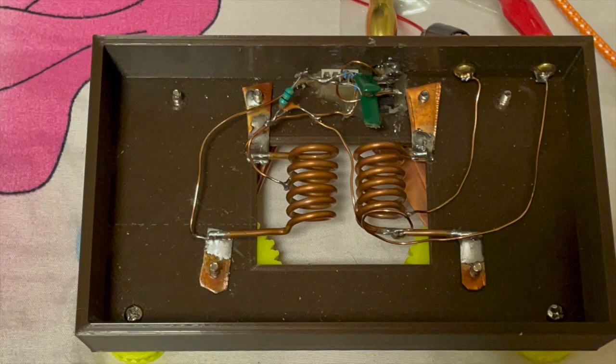You can see that I used some 0.5 millimeter magnet wires to connect from the coil to the circuit on the top. You'll find something that looks like a resistor — that is actually the choke coil, 30 microhenry.